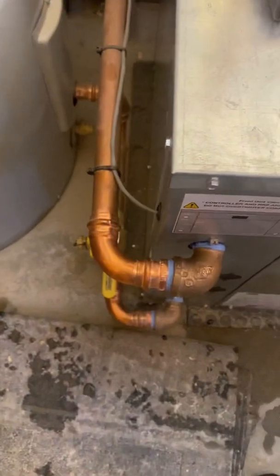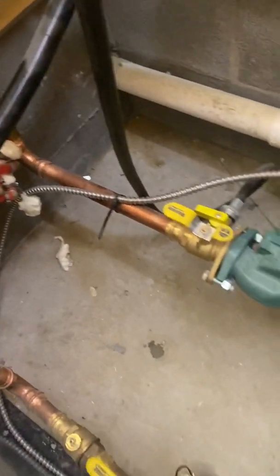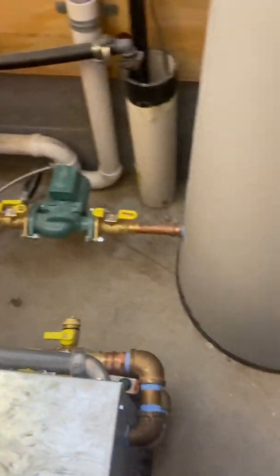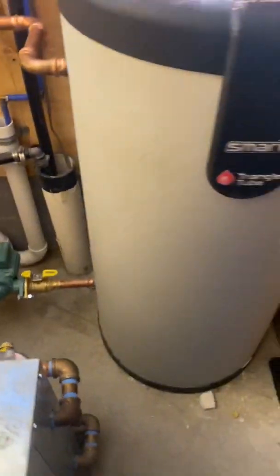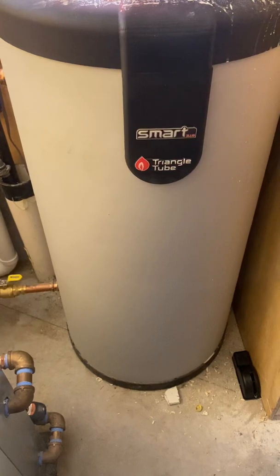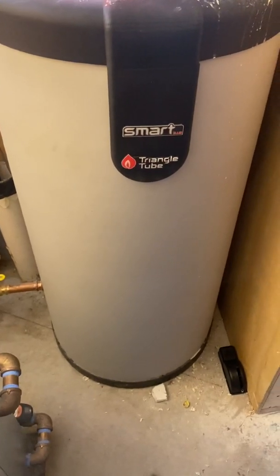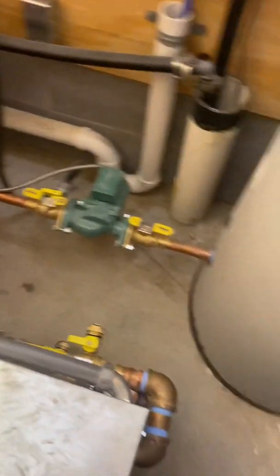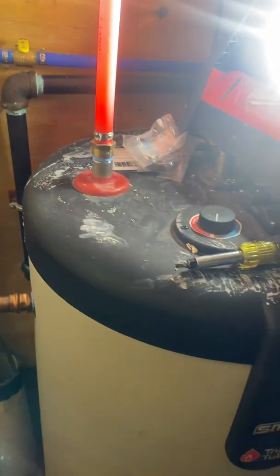This is one-inch copper and it goes around to the back — it's actually the bottom pipe underneath — and it goes around behind the heat pump and down into the hydronic loop circulator, which feeds into this indirect hot water heater. It's a full stainless steel design, 40-gallon, by Triangle Tube Smart Company. Our hottest water coming from the heat pump goes directly into that to preheat their domestic hot water.